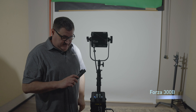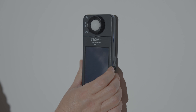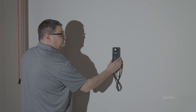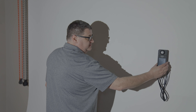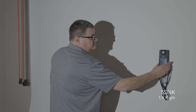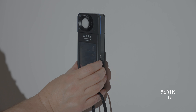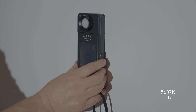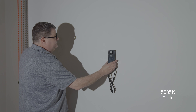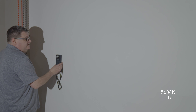You're also going to see TLCI and R9, which give us color information on the actual light, and an X and Y coordinate showing where things fall on the spectrum. We need to do a calibration — we'll click over, do a dark calibration, and click yes. Now it's calibrating the white point, black point, and everything in between. We also need to set the target to match our light at 5,600 Kelvin. We'll hit the target button, enter 5600, and hit OK. Our target is set at 56. Let's turn the light all the way up to 100% and take a reading.